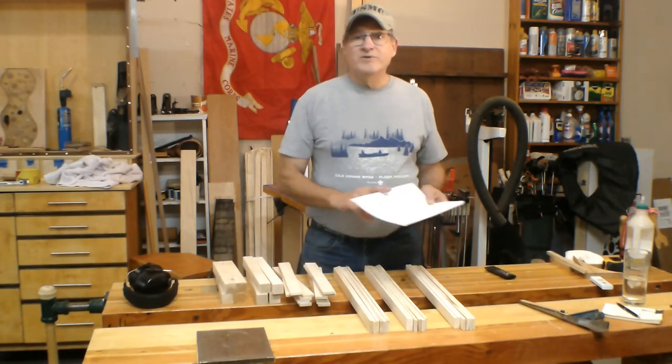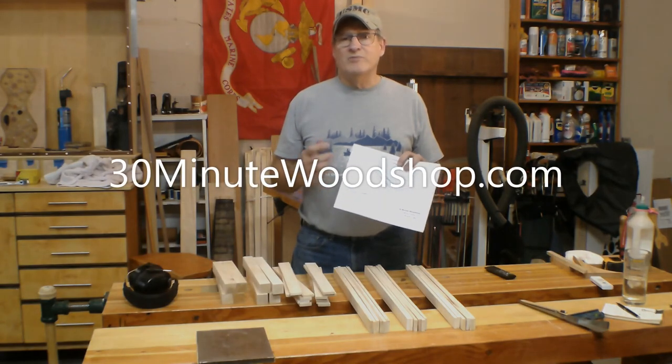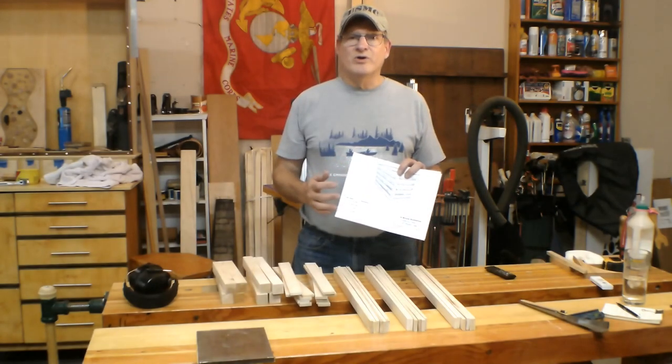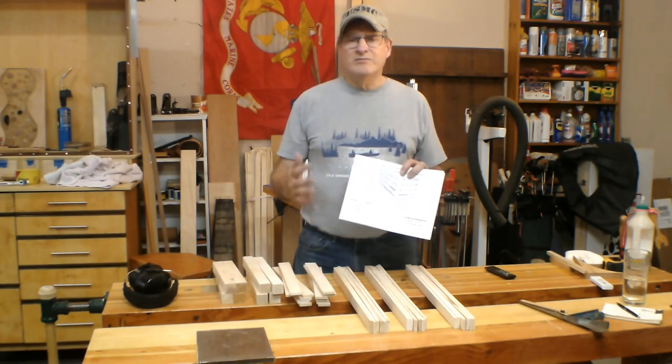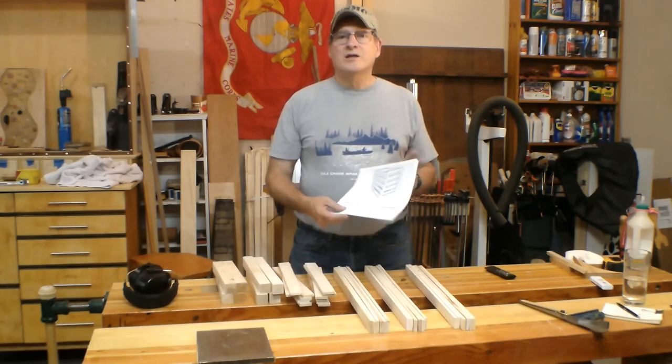You can go to my website, 30minutewoodshop.com. Take a look. You can get a set of drawings. The drawings are a little different than what I'm doing today. This uses milled lumber. The milled lumber uses slats that are 1¾ inch wide, 5 of them in each side and ends. In this case, we're using some lath, which is a little bit smaller, so it takes a little bit more.